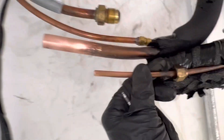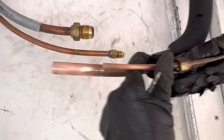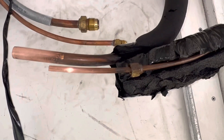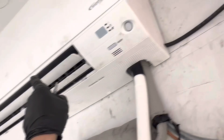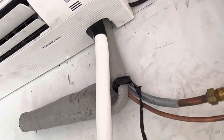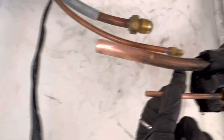Resize before you braze. I know some of you guys have scumbag bosses and service writers and estimators who underbid jobs and don't give you enough time, and you just have to hack it in. It'll work good enough and the customer won't know — but it's a little small orifice. This was supposed to be a 36,000 BTU unit, but because you quickly cut it and necked it down to a small hole, now it's only an 18,000 BTU unit — but it still comes out cold on the hand.